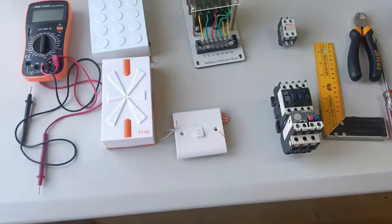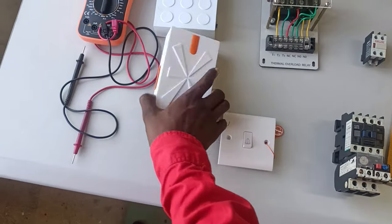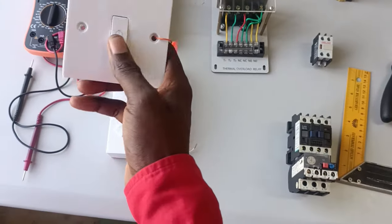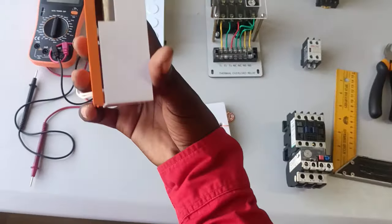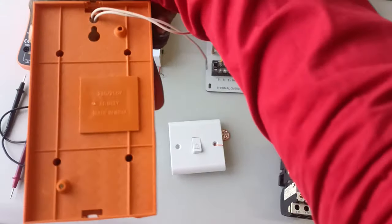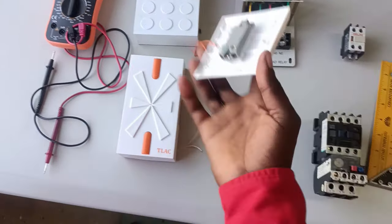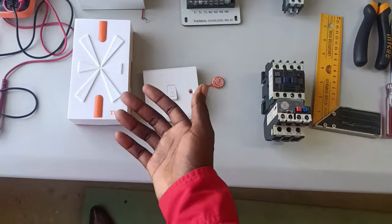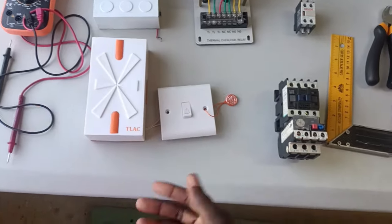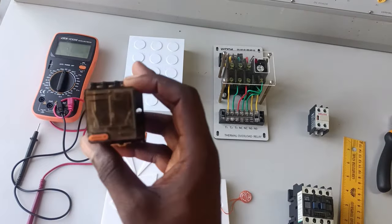Then we have materials. The previous videos talked about materials in a large category. Here let me talk about the AC bell — the bell you can use in your house. Instead of people knocking at your door, they click on the bell switch at the door and you get a signal that someone's there. This is an AC bell, not a DC bell. When using AC bells, you don't need a bell transformer because you're not converting AC to DC. But if you're using a DC bell, then you need a bell transformer, like this one here.